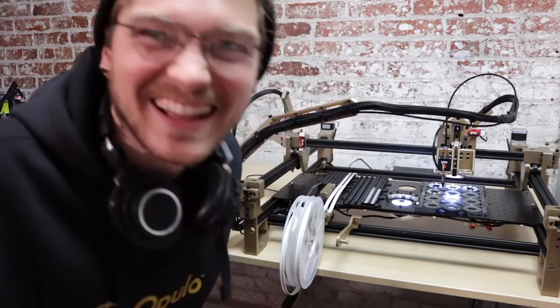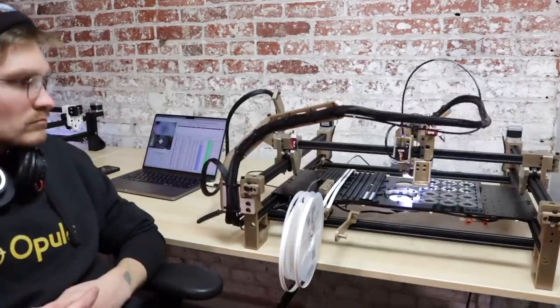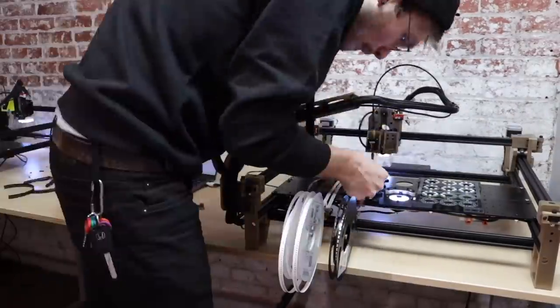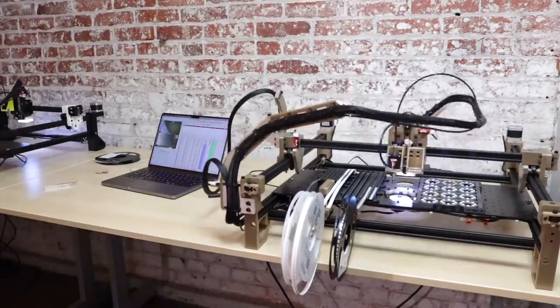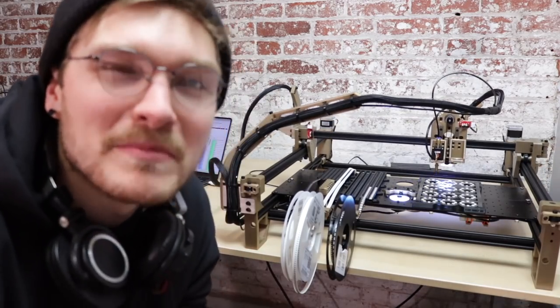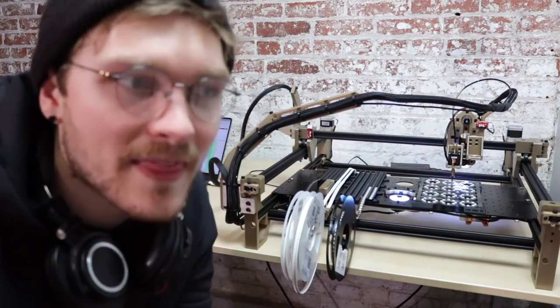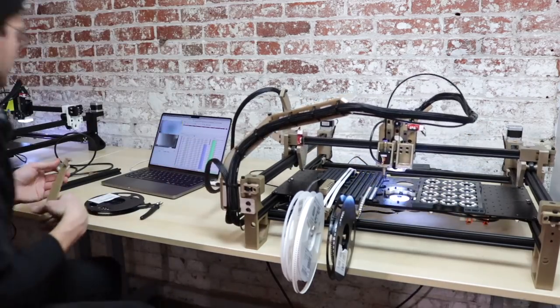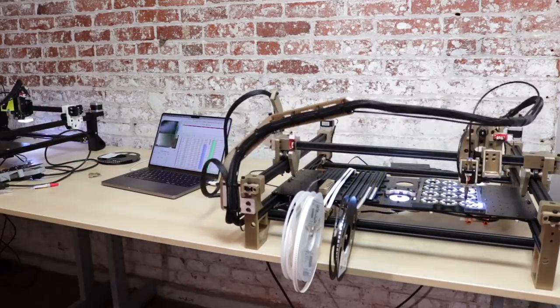I forgot to remove the film from my tape — it tried to pick but just couldn't get through. So I pulled the film off and set it back to running. It pretty much just runs like that for a while. I'm catching up on notifications and watching it run. Eventually it needs more LEDs so I pull the tape through and kick it off again. I noticed it paused at one point — my feeder height was set about a millimeter too high, so when the nozzle came down to pick, it was too far from the part and didn't grab it. I bumped the feeder height a little lower and it picked up just fine. These things are easy to miss during setup. The first few times you run a board on a machine you might notice a couple little things to tweak.